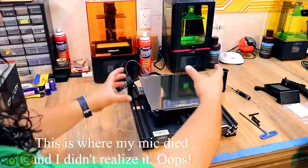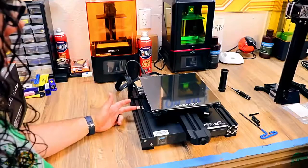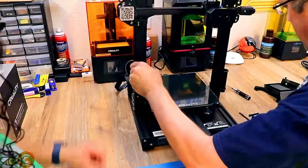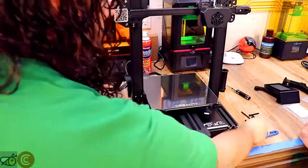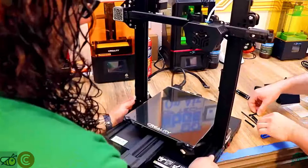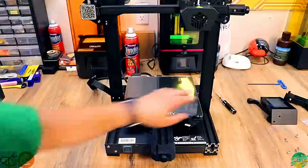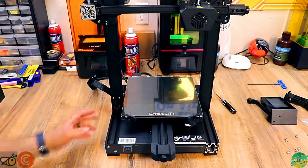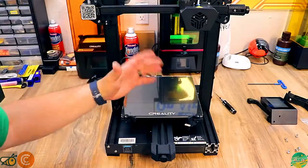The really cool thing about the CR6SE is that we take the gantry and set it right into these grooves, and as long as those grooves are cut correctly, the gantry should sit almost perfectly straight up and be in place. We set it in, then take our two screws and push them up through the bottom on both sides. Once all four bolts are tightened up nicely it should be really sturdy — no wobbling back and forth, nothing rocking.